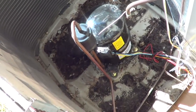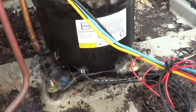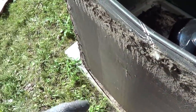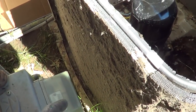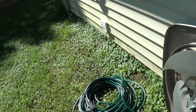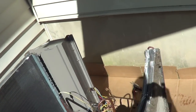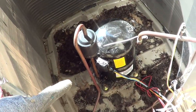We've got a bad two-speed compressor here — Bristol benchmark — figuring out why it went bad. A little bit of lint, a little bit more lint, a whole lot of lint. Cleans off easily, but that dryer vent there has got to get moved. You'd think it was far enough away, but apparently this corner is turning into a lint magnet.